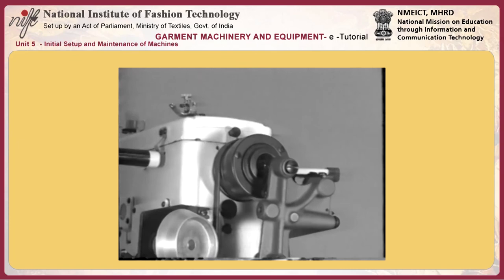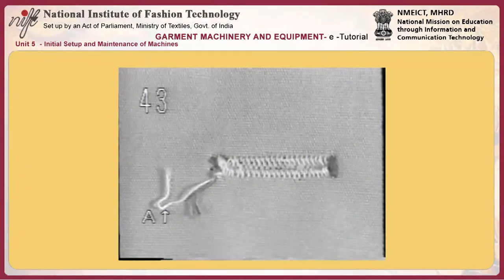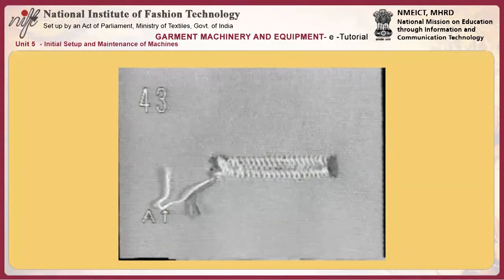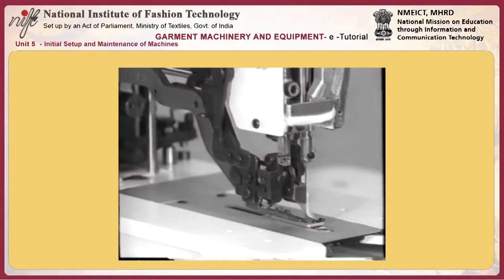To adjust the restriction plate, firstly, set latch A and catch B to the low speed operating state. Now, loosen set screw E in the restriction plate and adjust so that restriction plate C comes in slight contact with blocking arm D.